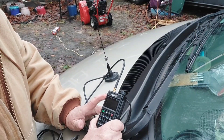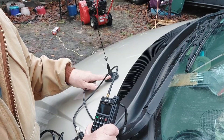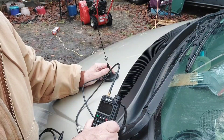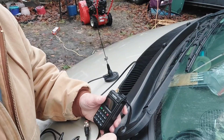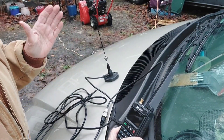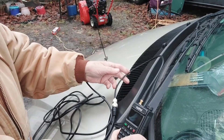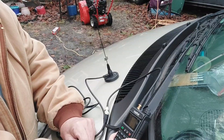It's very important to know which band you're on and that it matches the antenna you're using. If you don't know that this antenna covers any band other than two meters, just keep it on two meters. When you purchase an antenna, it will tell you what bands it works with. You can also construct your own antennas, but they have to be tuned for the frequencies they'll be used for. As a packaged solution, with radios around $25, the Diamond antenna around $40, and the patch cord around $10-15, you've got a complete, solid starter system.